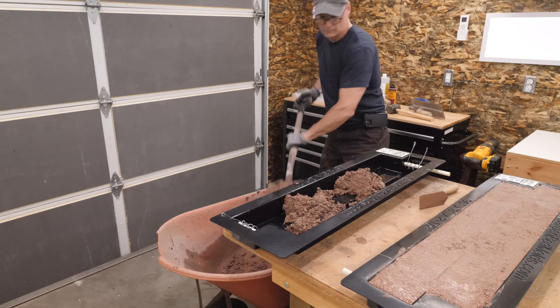For the next lightweight mix, I'll prep my molds in a new way — using finishing paste wax in the cavity of the mold and petroleum jelly on the pipes. With a cloth, I apply the finishing paste wax to all inner surfaces. It dries in only about 15 minutes, then with a clean cloth I buff away the wax haze until all inner surfaces are shiny. For the pipes, I'll brush on the petroleum jelly, which gives a good even coat that's thicker than just wiping it on. My goal with this new prep method is a better surface finish on the concrete and to make the pipes easier to remove if I've left them in longer than ideal.